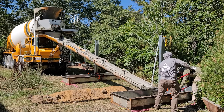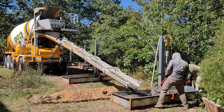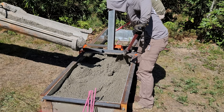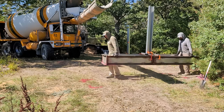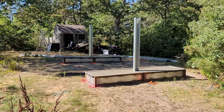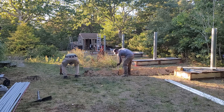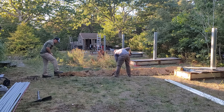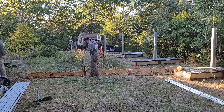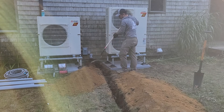We are behind schedule and the concrete is already starting to dry, which is very bad. We have to move very quickly getting the concrete into the boxes, spreading it and getting it as smooth as possible — making sure to get into all the nooks and crannies for a nice rigid set once it hardens. We move the other two boxes back into place, get them filled, and smooth them out for a clean finish. That was a very busy first day, and we finish it off by digging the trench from the solar panel stands to the house by hand to make sure we don't hit any sprinkler lines, power lines, or anything else in the ground. Normally we'd rent a ditch witch, but for this shorter distance we did it by hand.